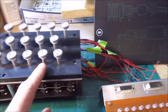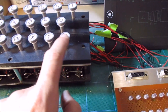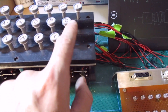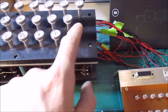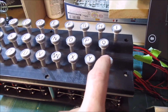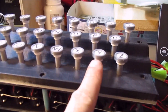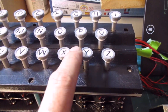One of the things I've done is I've replaced all the key tops. Originally I had painted ones with little pieces of glass — microscope cover slide — and people were quite rough with it and it would actually crack the glass because the glass is very thin. So I've replaced that with lettering printed on clear acetate, and I reprinted the bottom of the keys to be white plastic, so that's the white background you see on top of the keys.